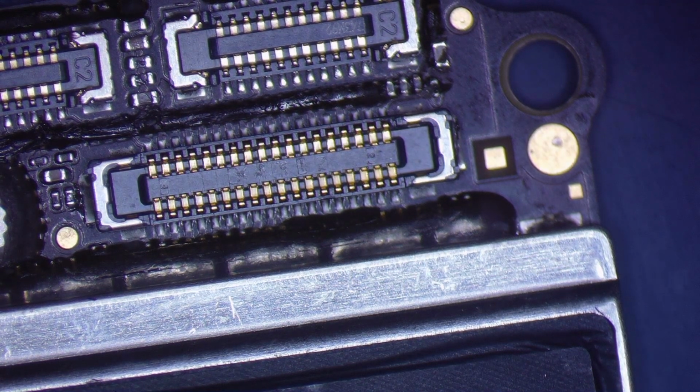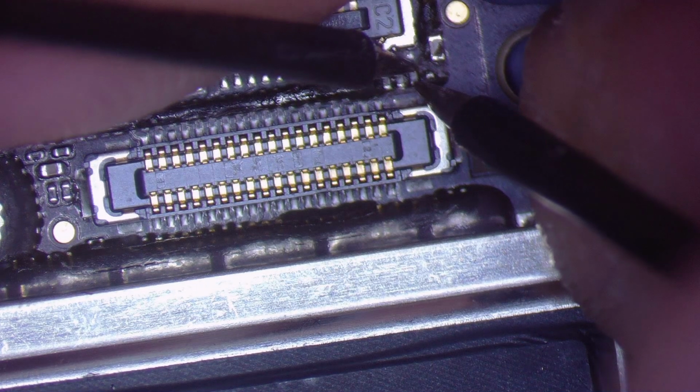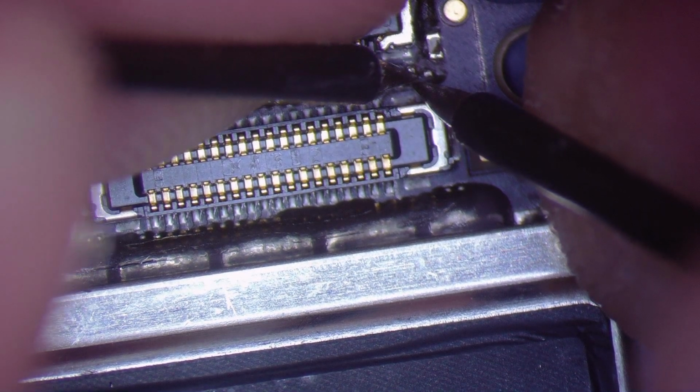Let's see if this fuse is still intact. Yeah, I get that measurement on both sides of the fuse. So it's probably still intact, but let's just check our continuity across it here. Actually, I do not have it, so it is blown. Oh no, there it goes. No, it is blown, okay. So just for testing purposes, I'm going to jump it real quick. It's not actually fully blown, but it should have 0 ohms across it, full continuity, and it does not, with a measurement of 121.